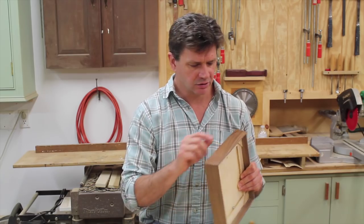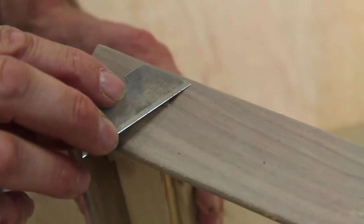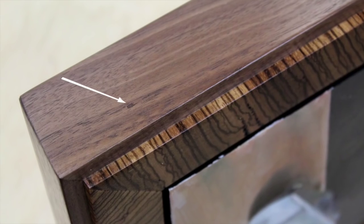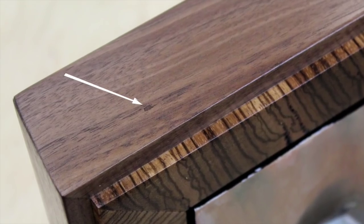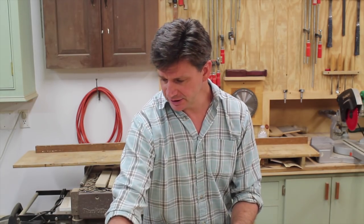I put the sawdust into the five-minute epoxy and that works really well, especially where there's no stain on the frame — the sawdust and epoxy mixture has a very similar tone. I'll get a nice close-up of this; it's really difficult to see. You're looking at the side of the frame, which you don't look at that often up close unless you're somebody who makes things and inspects how they were put together. I often use sawdust and epoxy as a wood fill.